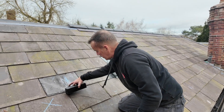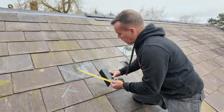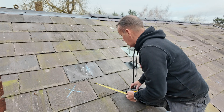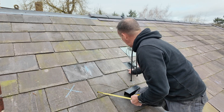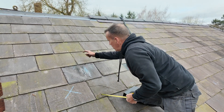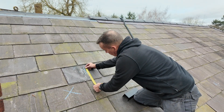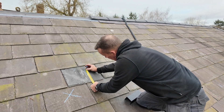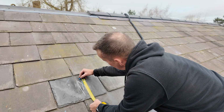So what we're trying to do now is — this is our rafter — we want to create the space to fit that there. So I'm going to measure up. Because we want to sit slightly up a little bit, we're set at 3¾ inches of headlap, to make sure we get onto the one above. I usually would cut at 190mm, but I'm going to go at 215mm, something like that, just so we sit a little bit higher.